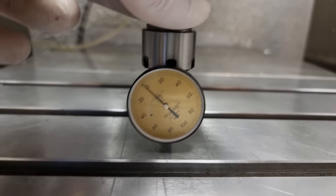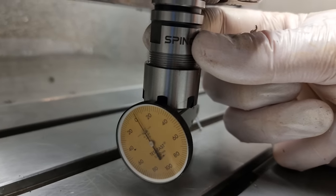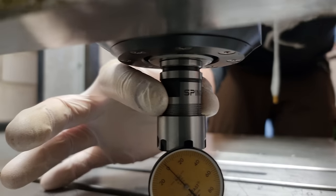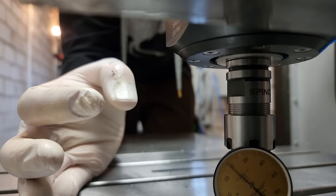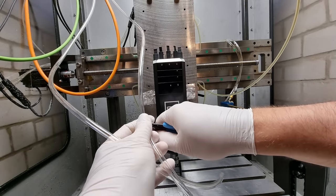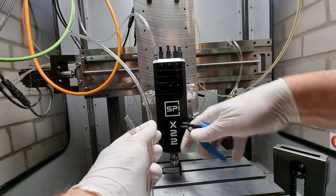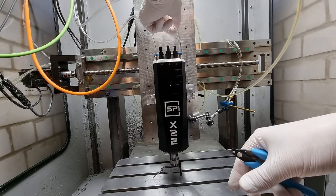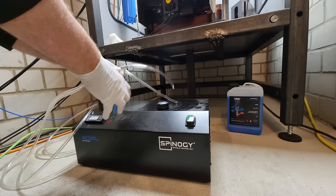I will be testing alcohol as a minimal quantity lubricant this season — another measure to make aluminum chips less sticky and more bearable, which might cause some surface quality troubles at first until I figure out the correct settings. These polyurethane hoses cost next to nothing compared to the spindle and water cooler, so after they went through shipping and potentially dusty storage, I just snip off a few centimeters off each end to lower the chances of introducing dust and aluminum chips into the coolant loop.